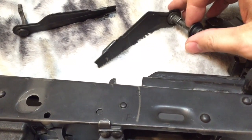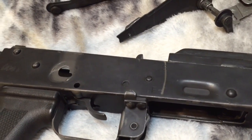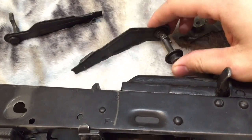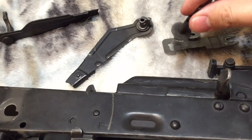I did this so I could be able to work with the parts down in the trigger group — be able to take them out, clean them, things like that. For example, if you have a bad spring in your disconnector, you want to change your hammer spring, you have to be able to take these two parts apart to do that, because your retaining plate is held in place by your fire mode selector.